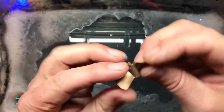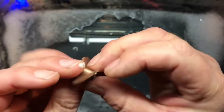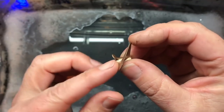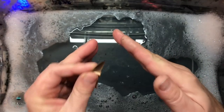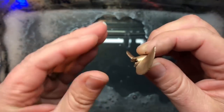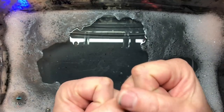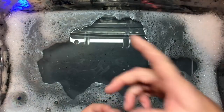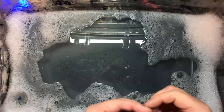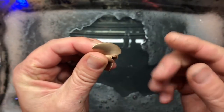What cavitation does - this is the front of our prop, this is the back, and we're screwing left-handed. So what happens is you're creating a high-pressure environment and a low-pressure environment, just like a wing. With the speed and the pressure dissipation, you're actually boiling the water, believe it or not. So when you boil the water on a real propeller on a boat - and maybe even on a model - you can actually burn the prop and get marks. It's really crazy.